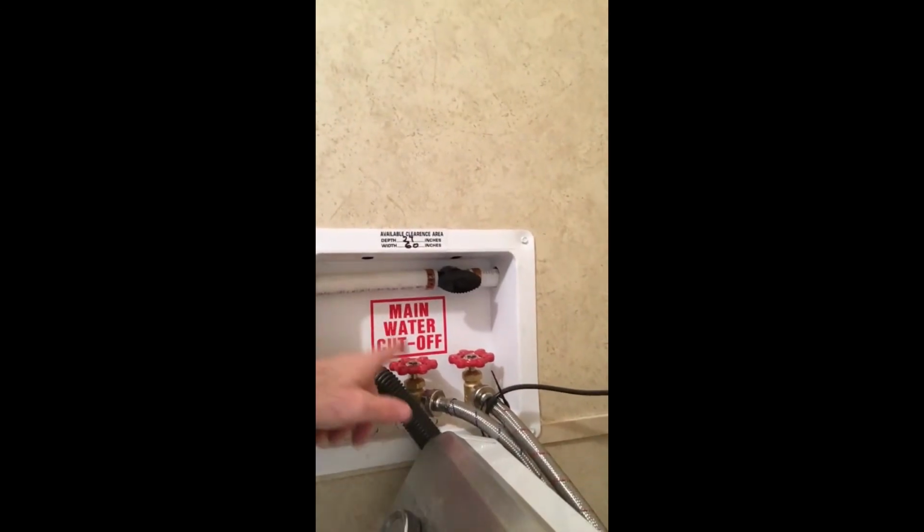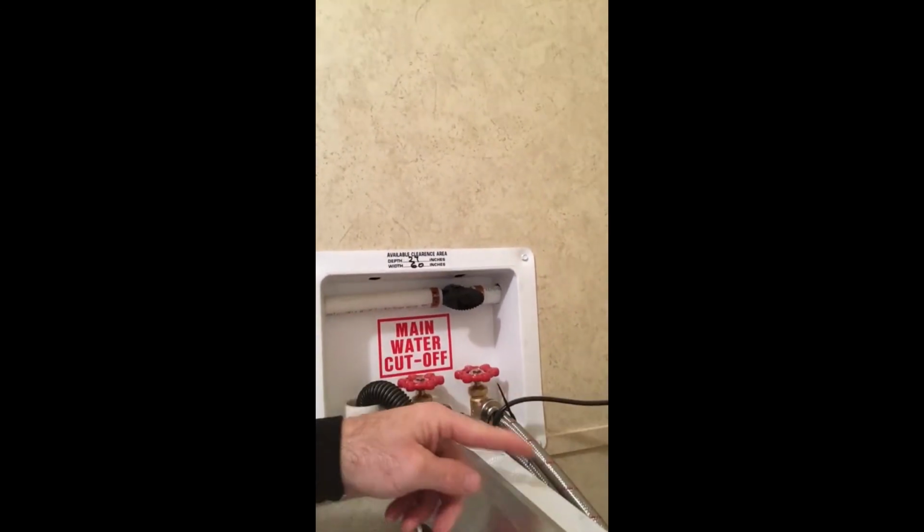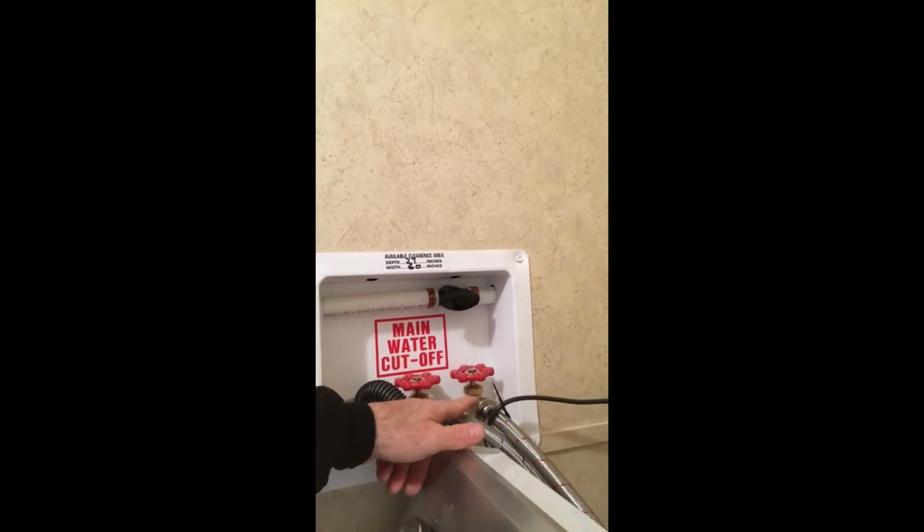And when you move these and you're going to take them off, there's little caps you could get, 3/4-inch caps, to put on there. Let me tell you, that has saved my butt a tremendous amount of times, because sometimes if you have the movers do it, they will forget to turn that water off. You rehook the water, you turn it on, oh goodness, we got a little bit of a leak and we gotta hurry up and shut that off. Sometimes it's not a big deal. One time it cost me about half a day's worth of repair, but you live and learn.